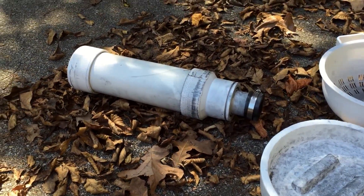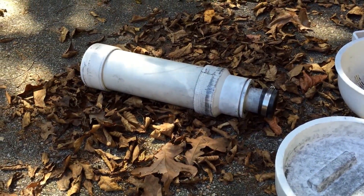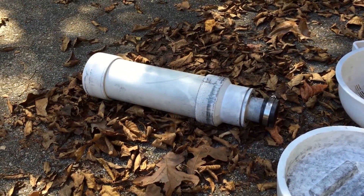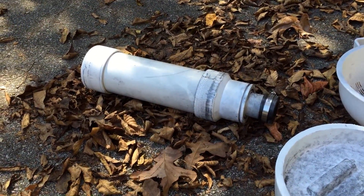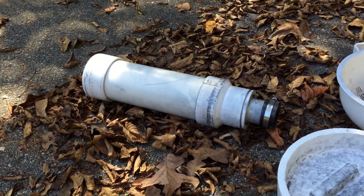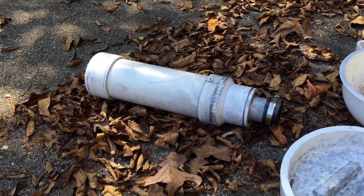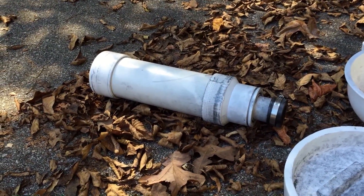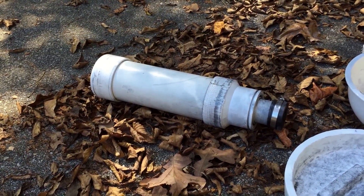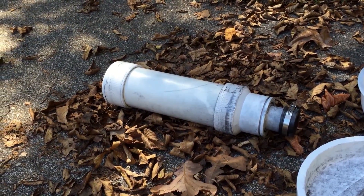When I turned it upside down I had to give it a little shake, and I bet what happened is I incorporated just enough oxygen in the wrong spot and it caused it to go. Looking down into the bucket, it just looked like a little piece of orange — like a hot ember had fallen into it — and it started to spread. It was a waste of about $150 worth of stainless steel media. I don't even know how much of that I'm going to be able to save, but we'll see.